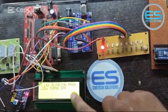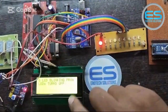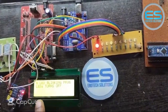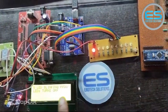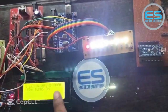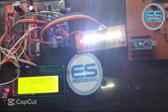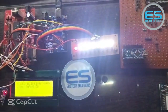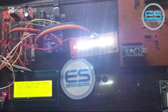The display supports four lines with 20 characters per line, and I'm just using two lines from this screen. The first line shows the message '8 LED blinking program', and as per the LED operation, I can show the corresponding message on the LCD screen — LEDs turn on and LEDs turn off with a two-second time delay. This is one basic application with Arduino. We will continue to give you more applications with these different controllers — 8-bit and 32-bit families. Thanks for watching.